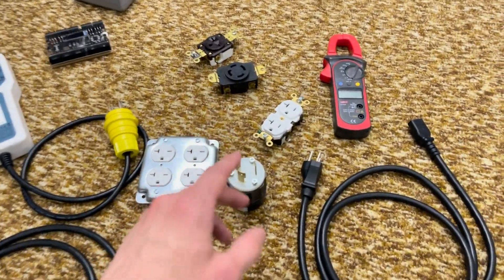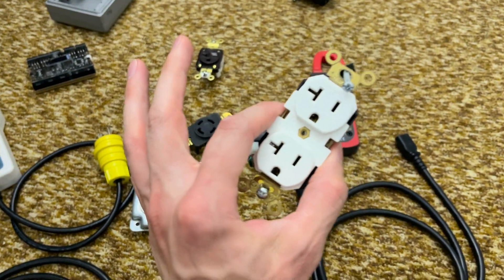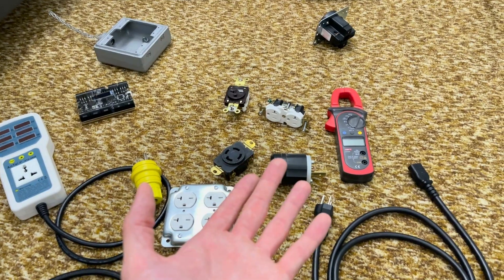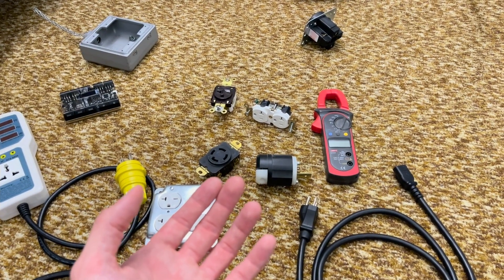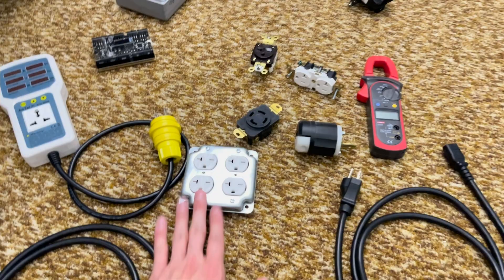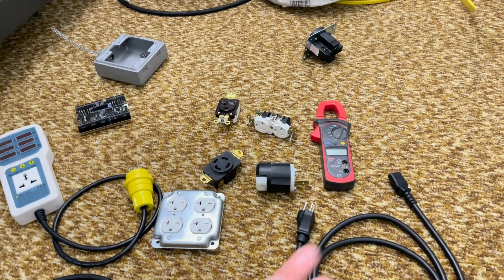Over time, through heating and cooling cycles, contacts will lose pressure — connections to the wire could degrade. So it just increases your risk with increased current, and it's non-linear. If you run a 20-amp circuit at 10 amps, it'll last probably a very long time, potentially your lifetime. If you're on a 20-amp circuit at 16 amps, you might have an issue with cheap outlets after five years or so. It's sort of an odds game — it's about acceptable risk, and I think it's worthwhile to spend a little bit more and not worry about it. If you have any questions or comments, leave them below — I answer a lot of them and maybe I'll make a video if it's interesting enough. Stay hashing.